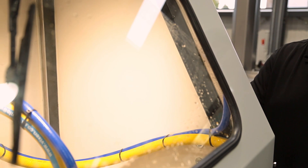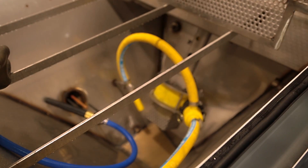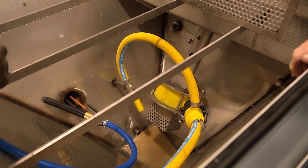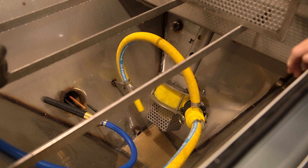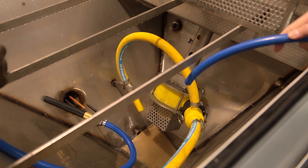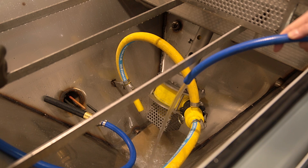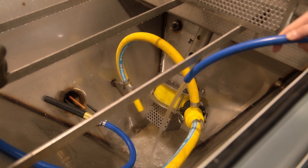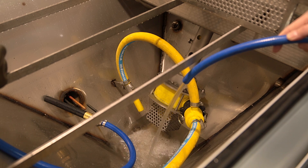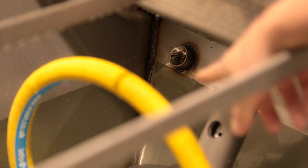Now that we're confident we have the proper rotation with the motor and the pump, we can fill it with water. I like to lift the grate up so you can see well into the hopper — it gives you a good view of all the components. The pump is a submerged pump with no packings — it's what I call a true slurry pump, and that sets Vixen aside from other manufacturers because it's tough and seal-less. We come out of the pump and branch into two flows: one goes up to the blast gun and the other is agitation, stirring up and giving a nice blend of the media in the hopper. We brought the water level up to about a half inch below the pinch valve — when we add the media that's going to bring that level up, and this level is very easily maintained in a closed loop system.